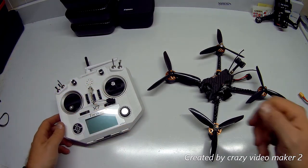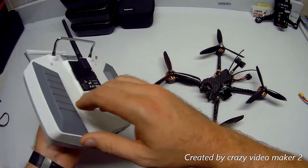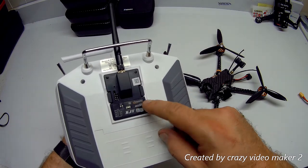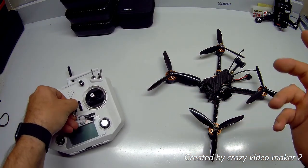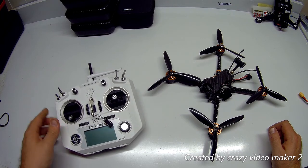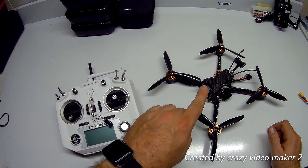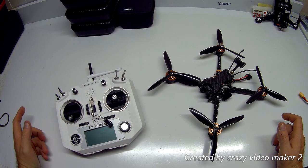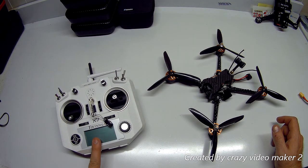I've been having trouble trying to get it to connect. You guys may have seen in other videos that I have the XJT module mounted on the back of this. One of the issues I was having was when I would go into bind, it was telling me I was getting the green light on the receiver — meaning it was bound — but on my Taranis I was getting no signal, no RSSI signal.